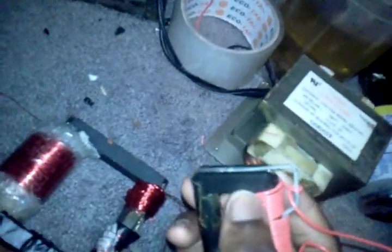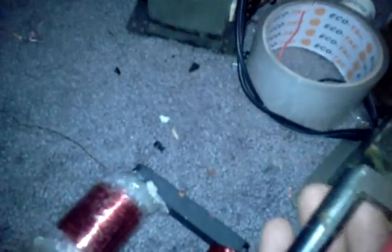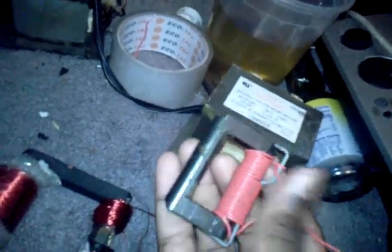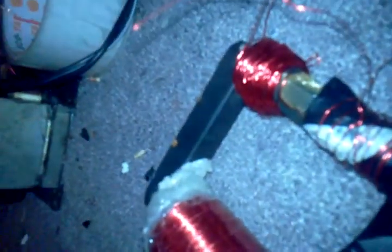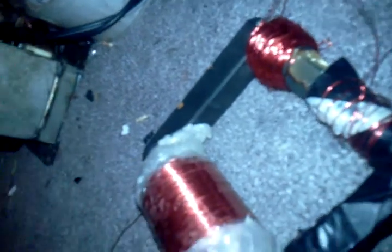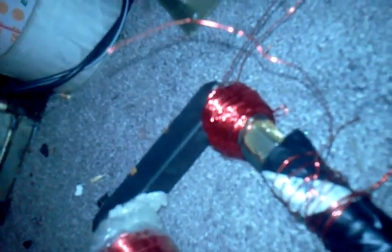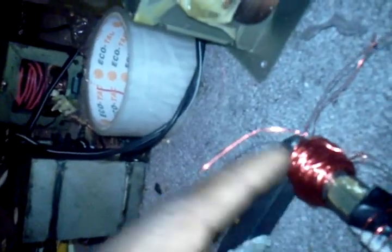Just so that way I can have another little quick flyback. It's kind of nice to have them around — you'll always have another flyback just sitting there waiting for you. It already has some windings on it, a primary coil. This new secondary has just about the same number of turns as the previous one — about 700 to 900 turns on it. The primary is different.